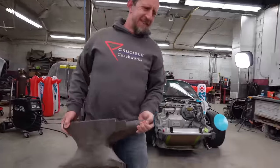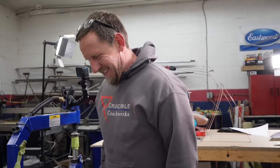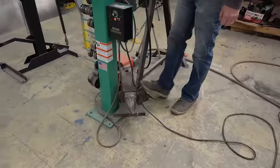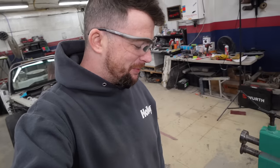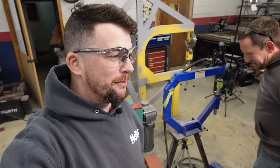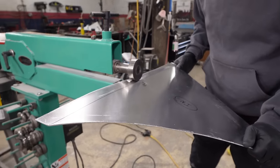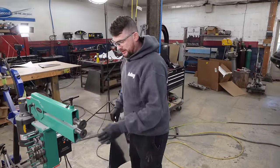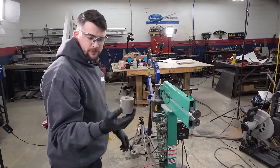I need to go to the chiropractor today - I didn't want to carry the anvil across the room. We have the bead roller lag bolted to the floor, but there's only one bolt and it's not fully tight. The reason is the drill bit necessary for that bolt died and we never got a new bit. Typically this die is wide enough for my flange, but I'm doing a bigger flange and as you can see it's kind of gouging in right here, which I don't like. I'm going to swap it out for the big boy.